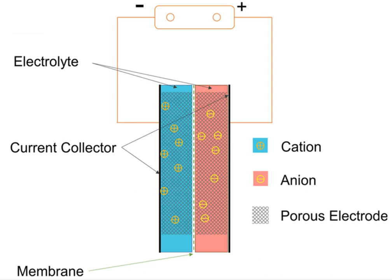The double layer serves approximately as the dielectric layer in a conventional capacitor, albeit with the thickness of a single molecule. Thus, the standard formula for conventional plate capacitors can be used to calculate their capacitance. C equals epsilon A over D. Display style C equals var epsilon frac A D. Accordingly, capacitance C is greatest in capacitors made from materials with a high permittivity epsilon, large electrode plate surface areas A and small distance between plates D.